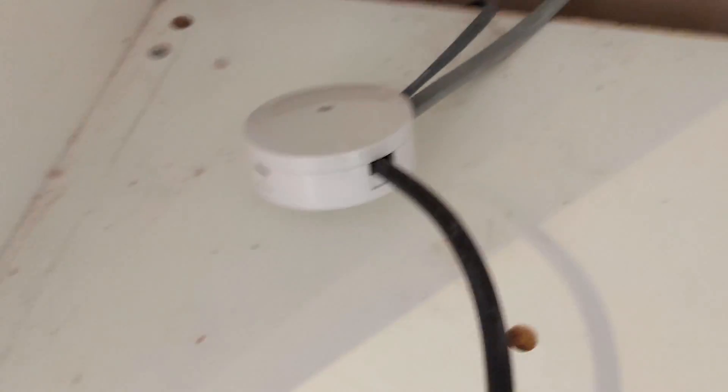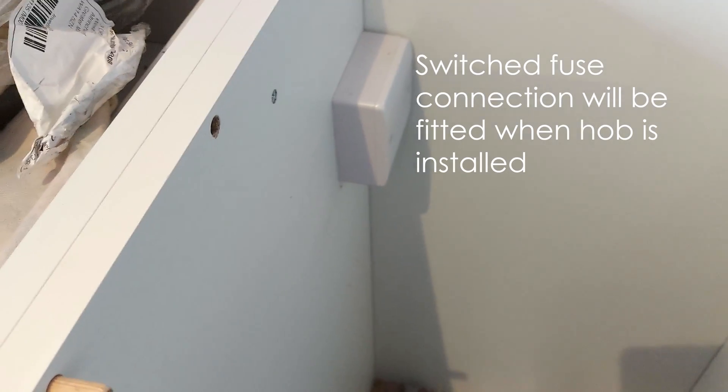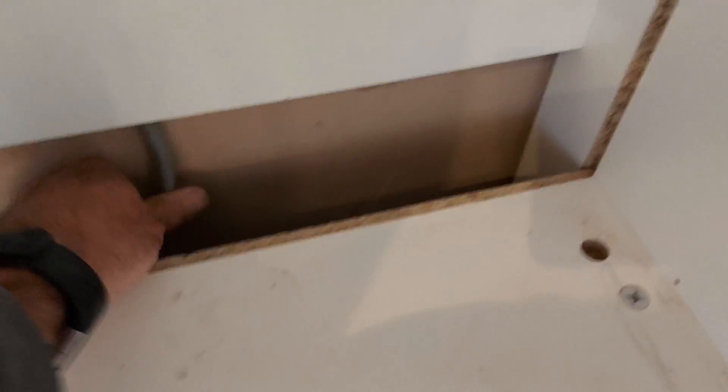This is how I do it — I can't see a better way into a junction box. I've got a two and a half mil feed for the hob, so I'll put the junction box under the blanking plate. Then drop down the back into the cavity and put some two and a half mil flex, connected to the oven. It's not H07 because I haven't got any, but by the time it's pushed down the back there it's nowhere near the heat source. H07 is a bit over the top for a cooker normally, but I'll probably get criticised.